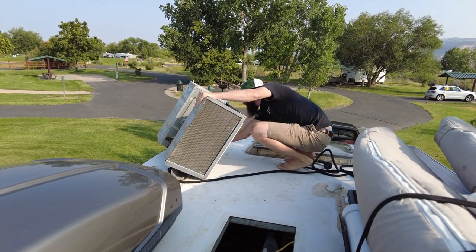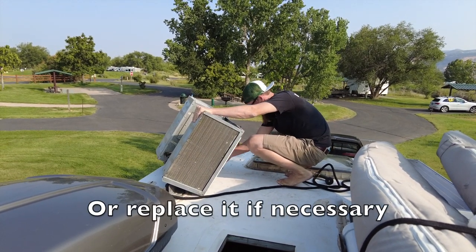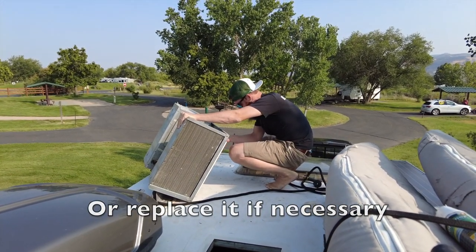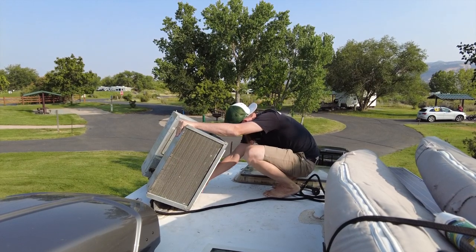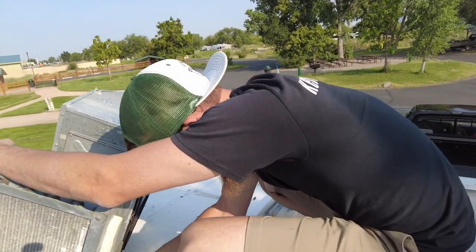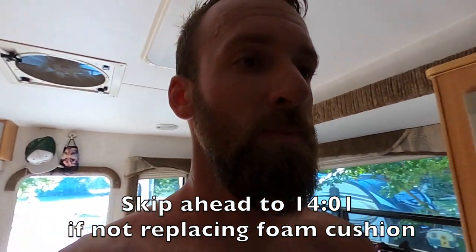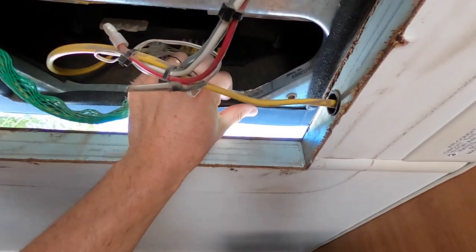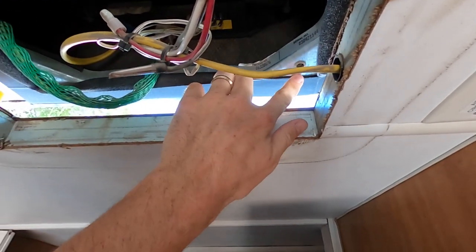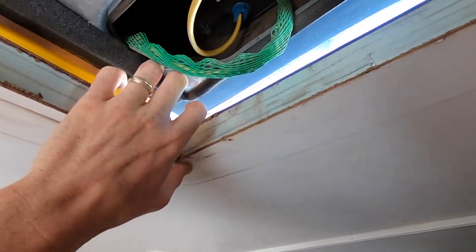Take this opportunity to clean off your cushion. There are actually a whole bunch of them down there — you want to get them all nice and clean, because any dirt in there is going to wear on your rubber roof. Today we are replacing the cushion seal on the air conditioner. This is the old seal — it used to be this thick, but when it gets squashed down like this, you need to replace it.